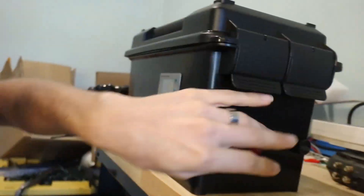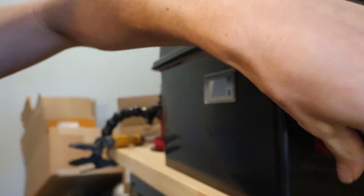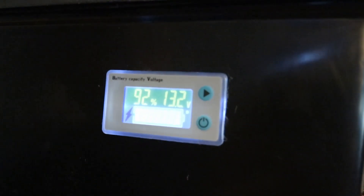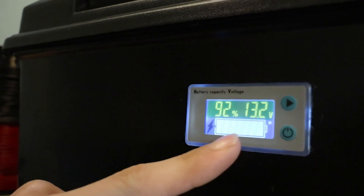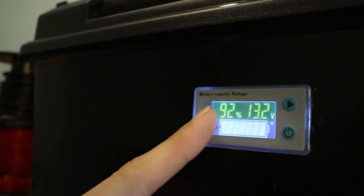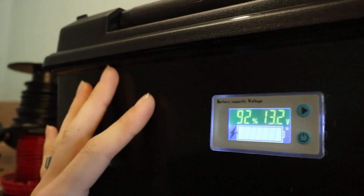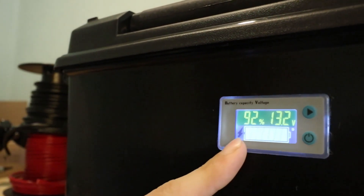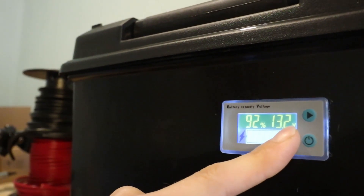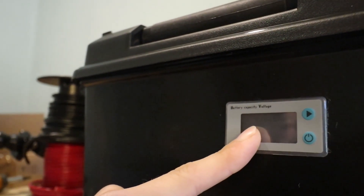I've got handy little screw terminals for putting your connections on. We've also got a voltage readout — this is really just basing capacity off of the voltage. You get to go in and determine what the high voltage and the low voltage are, so it adjusts for lead acid versus lithium iron phosphate versus lithium ion. I've got this one set to about 13.3 or 13.4 volts as the high voltage, and that gives me my percentage.